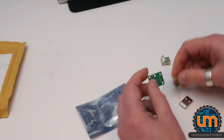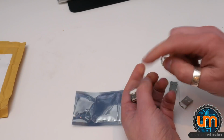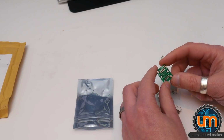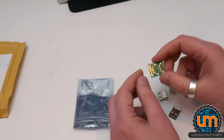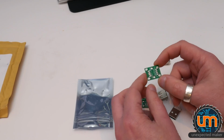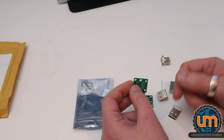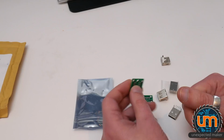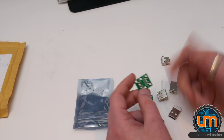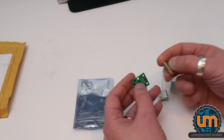Oh, that's great. So these are USB kind of middlemen. They sit in between a Type A here and then a Type A there, and what they do is they block the power going through. So you get data going through but not power. And these are super useful for 3D printers and for things like my laser cutter, which uses a Cohesion 3D controller board which is connected to my computer and is always on. Even when the laser cutter's off and the power switch is off at the actual wall, the screen is on the controller board because it's getting power from USB, even though it doesn't need it, because it's actually powered from the power supply inside the laser cutter. So these are designed to block that.